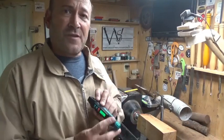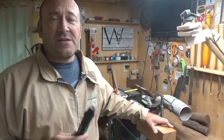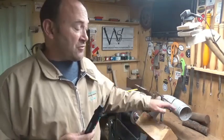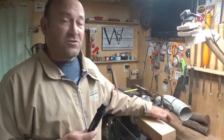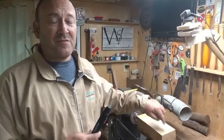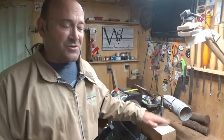That rough-turned bowl was between 30 and 34% moisture content — that's too wet to finish without it warping or potentially cracking, depending on how you turn it. This piece of cherry, on the other hand, I got no reading at all, which is great. As I turn it, maybe there's some moisture further inside the wood, and I can check it again as I'm turning, but I'm not too concerned about it.